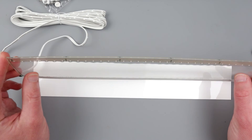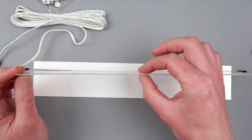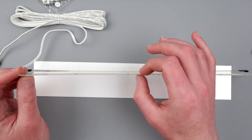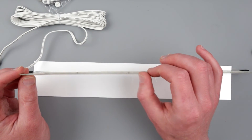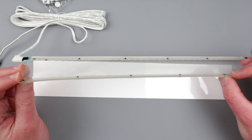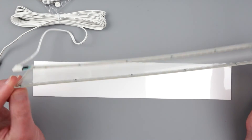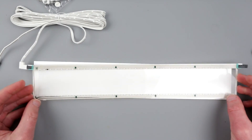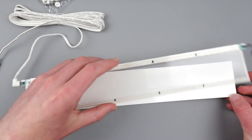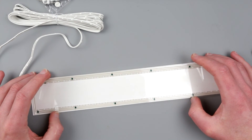Those traces are not made of rubber, so they won't be able to flex and still keep conducting. This is a solid chunk — about 3mm thick resin. A slight angle would probably be fine, but eventually you may develop cracks in the traces. If it were a flat ribbon cable glued to something, it would be fine, but this is one solid piece of resin, so cracking is possible. I'm still going to do some experiments though, because this is actually looking pretty neat.